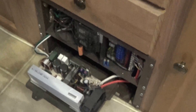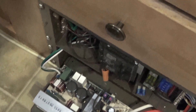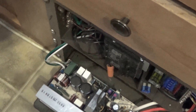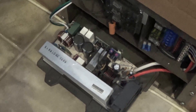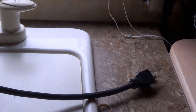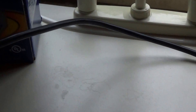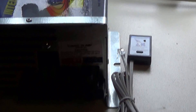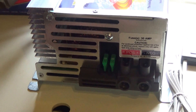So what I'm going to do is on the left side you can see green and white but there's also a black wire right here. I'm going to cut those and put a female end on, and then I'm going to cut that red and white and just pull this heap out. This unit comes with the plug on it, so I'll just plug it into the female plug that I wire onto the wires down there, and then the DC wires go into the business end of this unit. Hopefully it will be pretty straightforward and not too difficult.